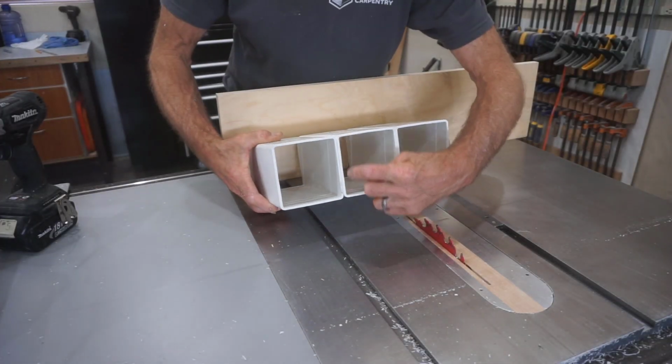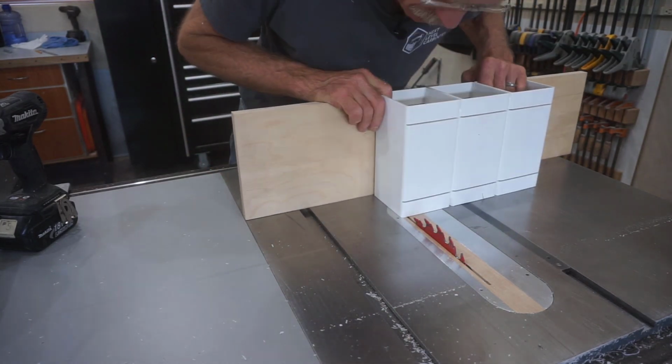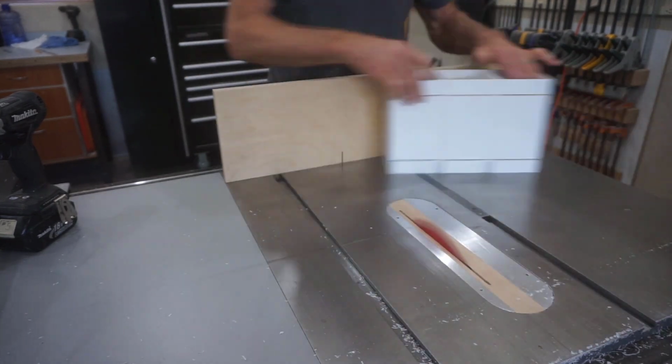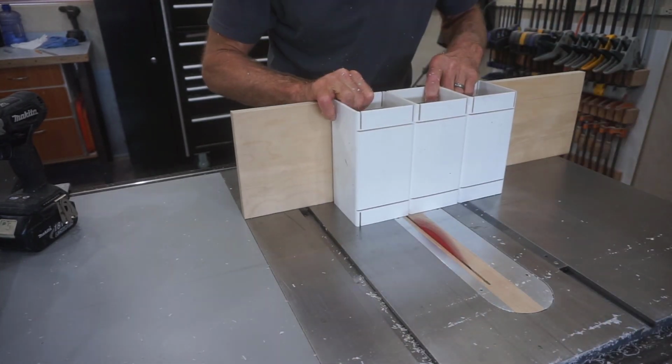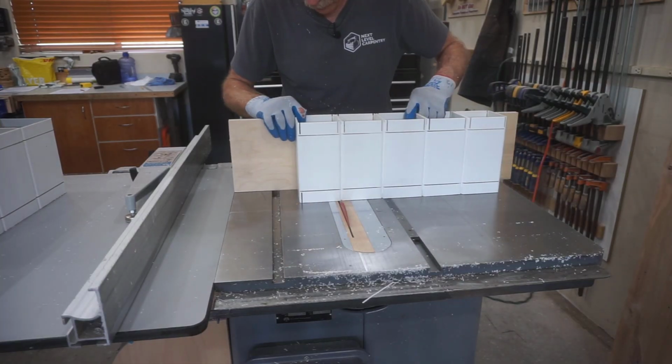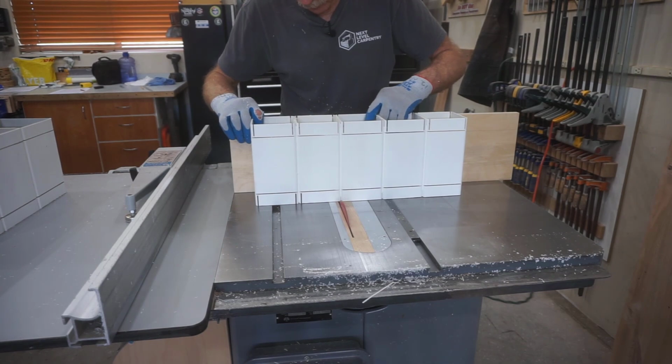All you need to do is miss the vertical compartment dividers, but pay close attention so you're not hit by flying pieces if they break loose while cutting. And if you're uncertain how it's going to work, wearing a face shield during this step just might be a good idea. I try to get within about 1/8 of an inch of those vertical dividers, but anything that's left will just get trimmed off in the next step.